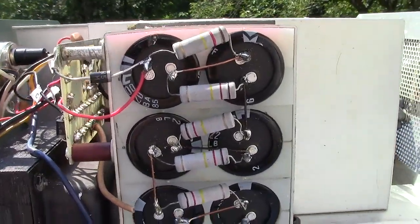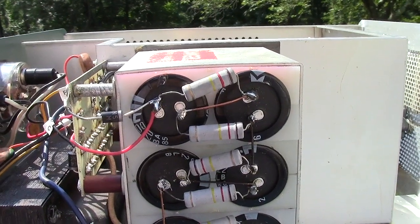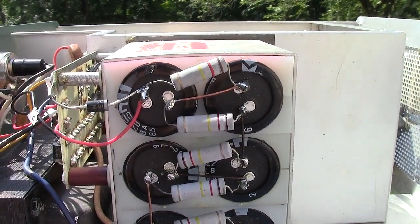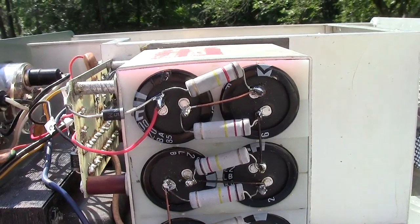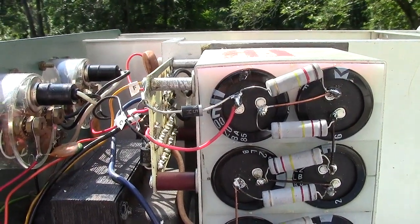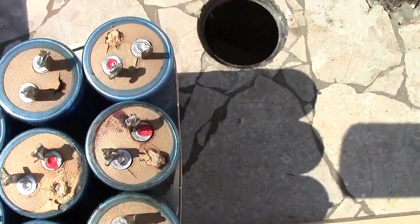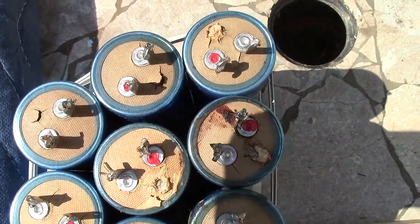What you're looking at now is the capacitor bank. I redid it in my own style to try to save $150. I like to use the hard box stuff but it's expensive, so I got these capacitors off the internet - they're an inch in diameter. I popped them in the tube holder the way it came from the factory. I had some serious problems: every one of these capacitors has been compromised. I didn't measure them to see if they're a short, but every one of them is damaged. No good could come from trying to plug this thing in.